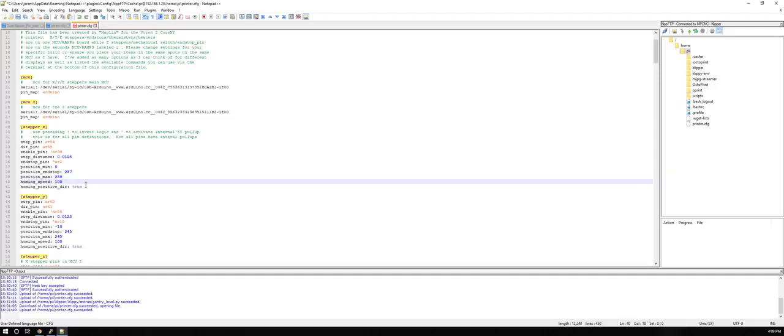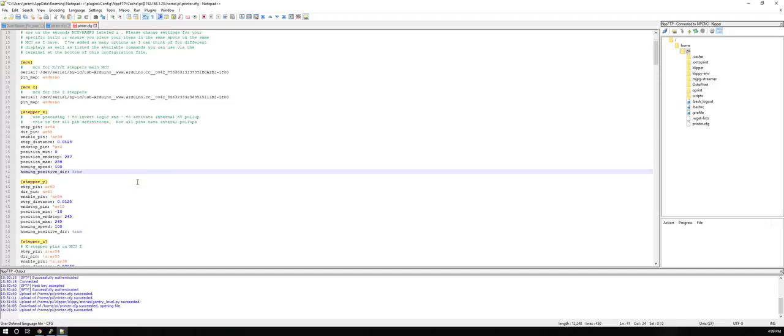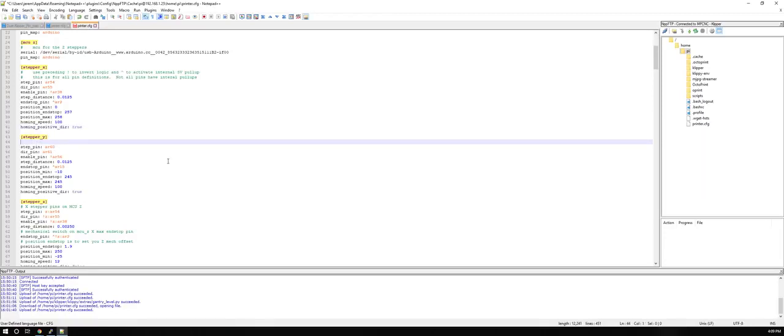And then you change your homing speed here. And we are homing on the Voron 2 to max for X and Y. So you want to change your homing positive direction to true. Again, if you're using my config, you don't have to do that. Just make sure that it's in there that way. And then every other stepper is the same. It's funny, I just realized I didn't add a comment on my stepper here. So, like Y, stepper, pin, on MCU.